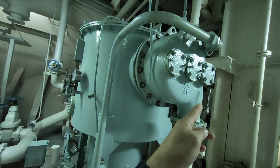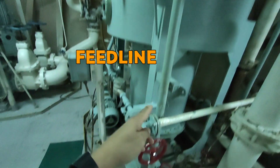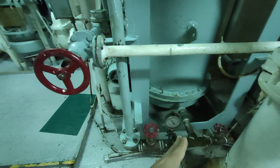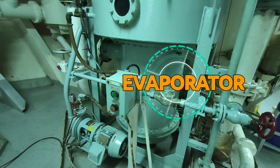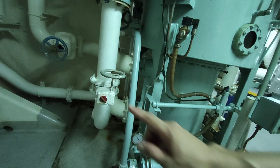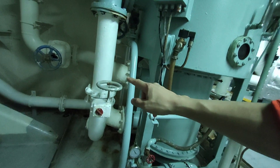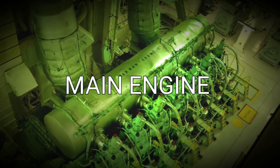While some seawater passes through the condenser, some seawater from the last stage of the condenser will go through the freshwater heater or evaporator — that's where the first conversion begins. Seawater is heated up by a cooling medium. On board ships, we use the main engine jacket cooling water for heating the fresh water generator, because it's economical — the heat generated by the engine is recovered.